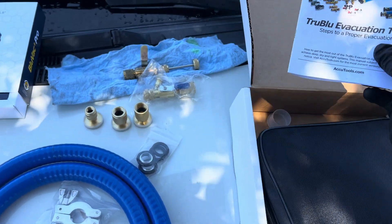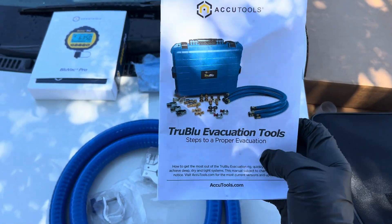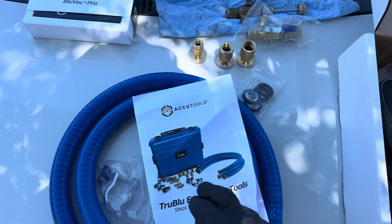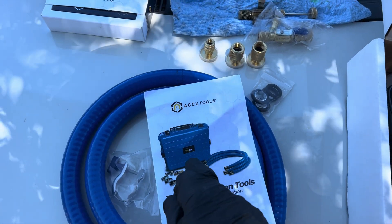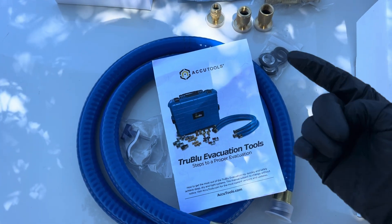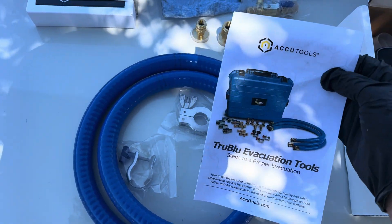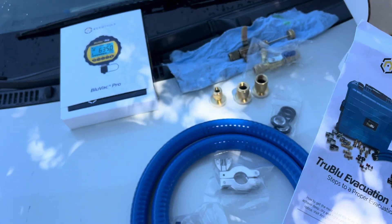So that is the kit — not that other kit. I have that kit too, but it's rather more expensive. That's what I use on commercial jobs when I'm selling one of the big heat recovery units, because it has three copper pipes coming out of the commercial unit — one for reheat — and you draw a vacuum from three different ports at one time. They don't have a two-pipe system; they have a three-pipe system.